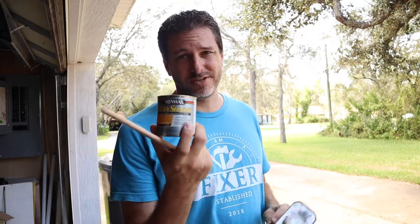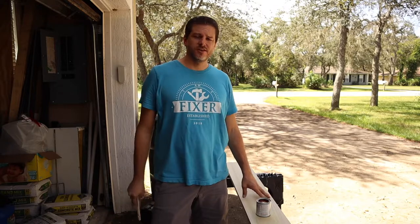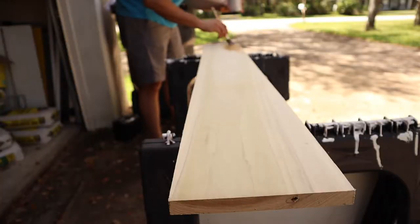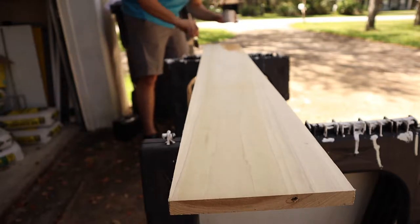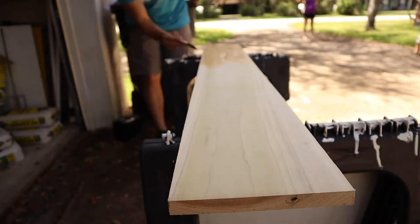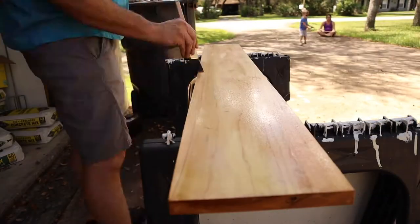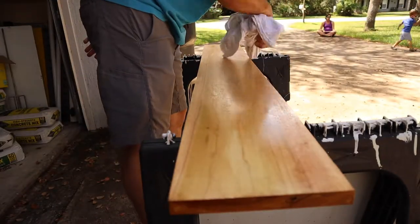It says there's a six-hour cure time, so we're going to do it and then give it some time to dry and do a second coat. We're going to do two coats — first the top, then after it dries, come back and do the bottom. The big thing is that you don't want to put this on thick; just do real light coats. I'll have a rag handy because I'll probably wipe some of the excess off. It's actually a very light stain — it's not going to do much, it's just going to protect the shelf. Any places where it's on too thick, just take a rag and wipe it off.